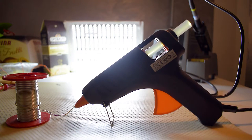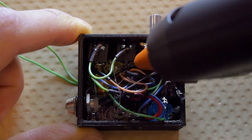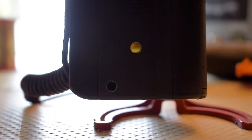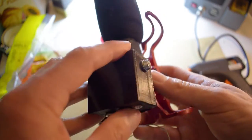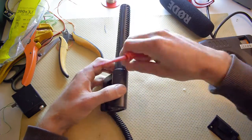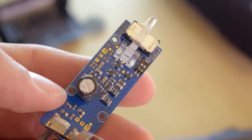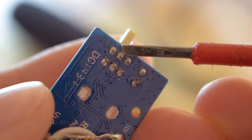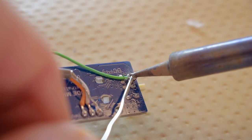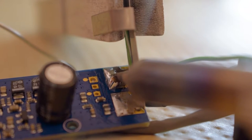This was my Christmas present. To fix everything in place, I've used a good amount of hot glue — I hope I won't need to open it in the future. The idea is to turn everything on with just one switch and share the same battery. After disassembling the microphone, I found that this pin on the switch gives power when it is turned on, so the amplifier power cable will be soldered there. Some hot glue for protection and a clip to hold the negative wire in place — this wire is connected directly to the battery.